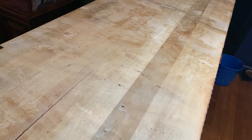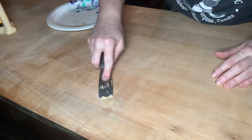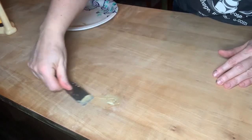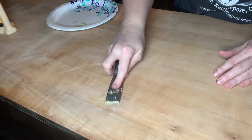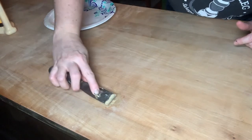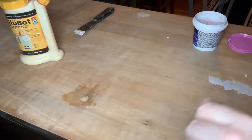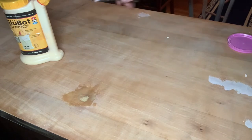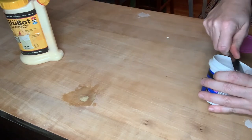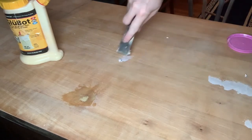After sanding, make sure to dust your surface really well. The next step is to patch. For larger holes I like to use a mixture of wood glue and sawdust — I'm using Titebond 2 wood glue for this, and that really helps to fill in the cracks well, a little bit better than spackle. For the rest of the smaller holes I'm going to be using just regular wall spackle to fill in all the holes, and then I will sand everything lightly with 120-grit sandpaper.